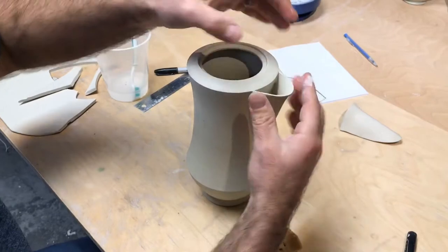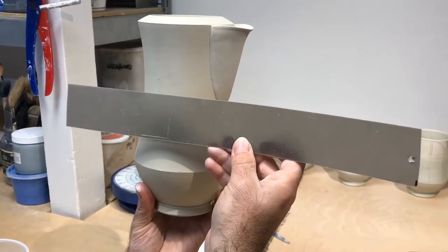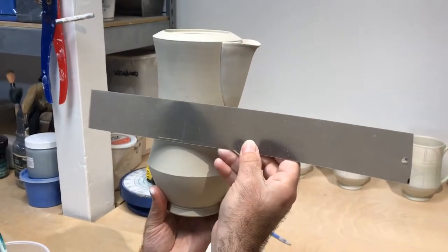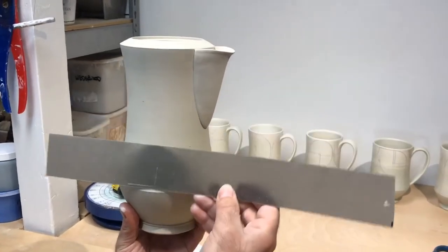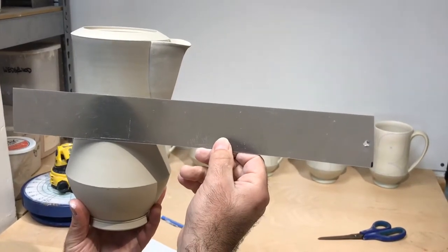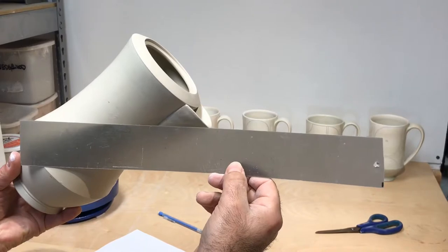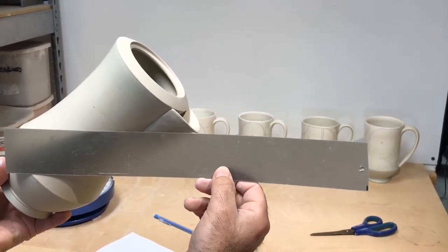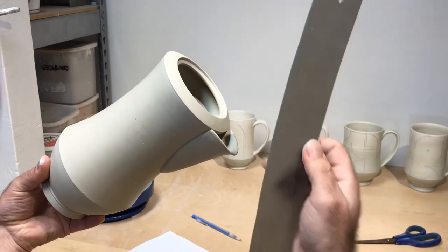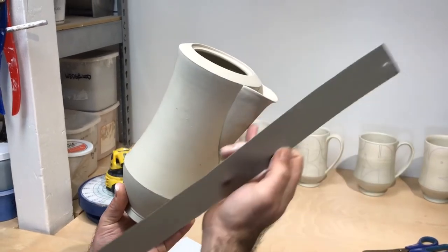I just want to talk for a moment about getting these types of pots to pour well. When we're going to pour, we want the coffee pot not to drip. I'm going to use this piece of material to show where the water or coffee level would be. If you fill this pot up to the point where coffee would start to move into the spout and then start pouring — at the point where coffee will start coming out the spout, the edge of that spout is almost vertical. That's a good indication that the pot's not going to drip. This edge is almost vertical, which means the coffee can fall off and when you right it, it'll just get cut off rather than dripping down the front of the spout.